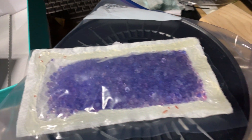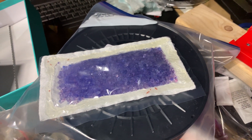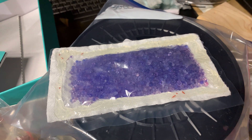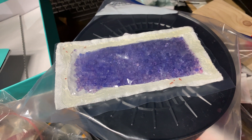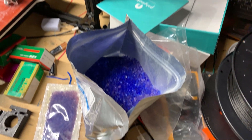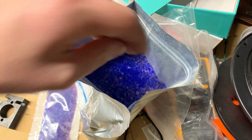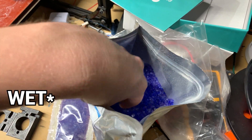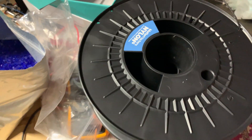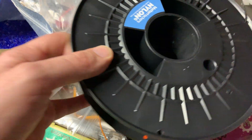I'm going to show you how we're going to dry both this filament and that silica bag. We're not going to do any printing — just trust me, it makes a difference. Especially on nylon. PLA is hit or miss; a lot of times PLA prints fine no matter what. On a really rainy day PLA can get wet, but it even dries on its own. After I made that video last night, I got sleepy and left the bag open, so the brand new silica got wet. Just don't leave your bag open overnight. I've got my nylon right here and I still have the one I left out overnight.